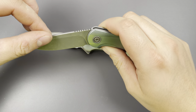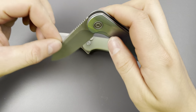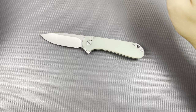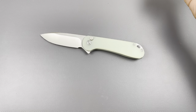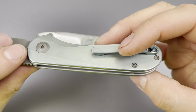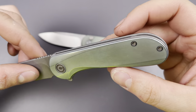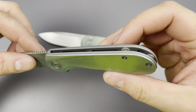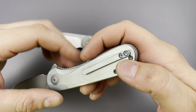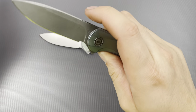I learned the hard way that you should put something to protect the detent hole and the area where the bearings are, because ferric chloride acid will eat away at the metal. I also did the same to the steel liners - they're just slightly shadow boxing the titanium scales, which are also anodized and slightly polished. There's the aftermarket titanium pocket clip you can get from Amazon - they come with matching titanium T8 screws, so now the whole knife is T8, which is pretty sick.